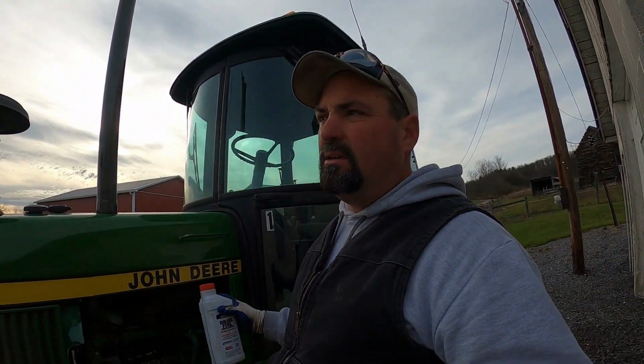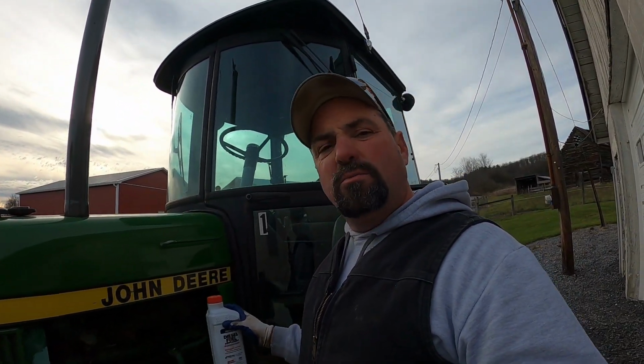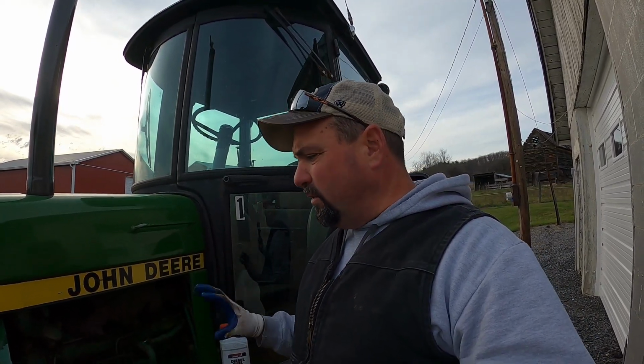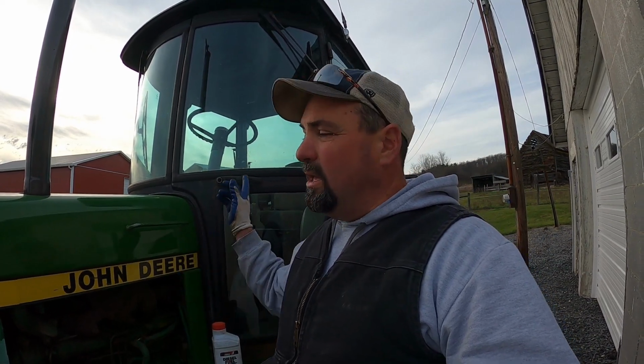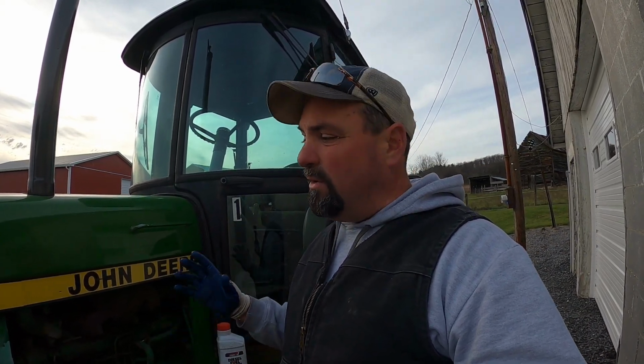So what I do is I put in our diesel tank some anti-gelling, but I find that with the fuels nowadays, they have a higher level of organic matter, which makes them gel more. So I'm going to put extra in the fuel tank before I fill it up with diesel. And then I'll let it run for a little bit to make sure it gets all through all the lines. It's just an important process because if not, we'll go to start this sometime when it's colder, and you saw how much trouble I had already today. But if it gels, you're not getting any fuel through it and it just will not start. And so we've had that happen.